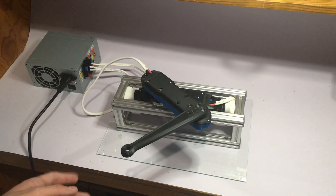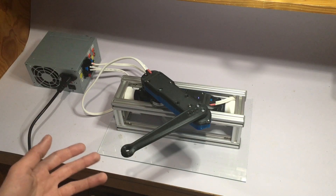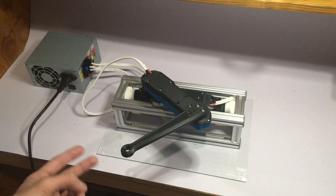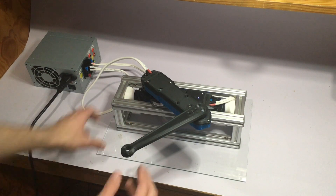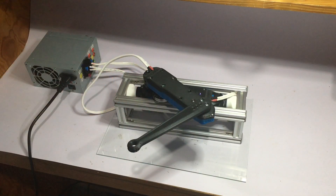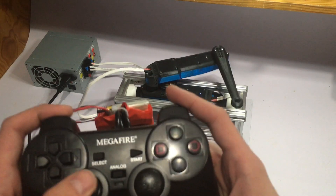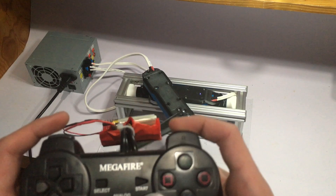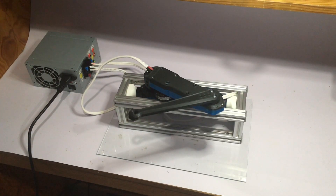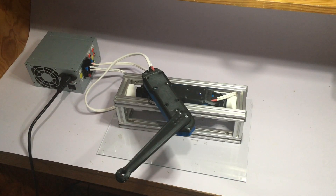I finished the assembly of the whole leg. I'm not sure yet whether this robot will have two or three degrees of freedom per leg, but right now I'm sticking with two. These actuators are very easily back-drivable, which is going to help a lot with the stability of the robot and natural compliance. Right now I'm just controlling the position of the actuators with my ESP32 controller, but in the next video I'm going to calculate the inverse kinematic model of the system and build a proper test stand.